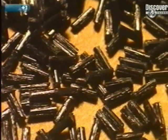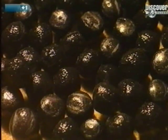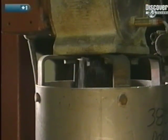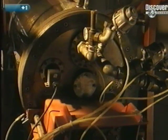The foam interior of the helmet, placed inside the shell, is made of polystyrene beads that will expand and bond together. An expander increases the volume of the granules that fall into it. Steam and an agitator force the polystyrene beads to expand uniformly. The granules are now ready, and the contents of this bin will produce about 20 foam pieces, which will take shape on moulds.